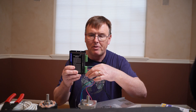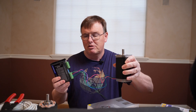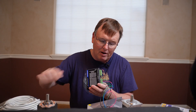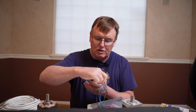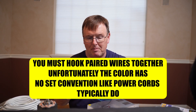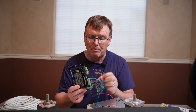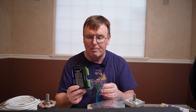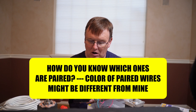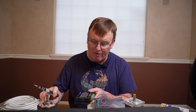All of these wires down here are coming from a NEMA motor. When I really build my CNC, I'm going to unhook these four wires and put in a piece of shielded cable, then crimp a connector onto each one. It does matter exactly how you hook these together. You cannot assume the wire colors on the NEMA 23s will always follow the same convention. I found that red and blue were paired, and black and green were paired. How do you know which ones are A-plus, A-minus, B-plus, or B-minus?